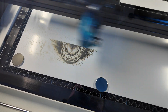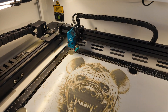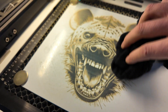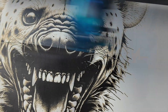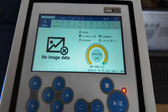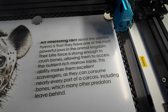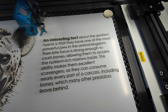The other thing was that I had to engrave the image twice. Even though I was trying to get rid of as much dust as possible, going in or out of focus did reduce the dust, but there was still some there. You can see when you engrave it twice how nice and rich it just pops, which was great. Unfortunately you have to do the images twice, but when it comes to the text you only have to engrave that once. I was trying to get it to work engraving the image once but no matter what I did, it just wouldn't work.